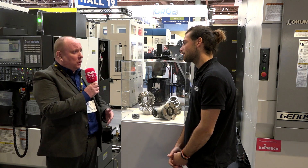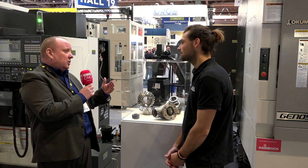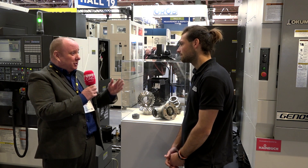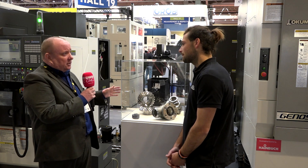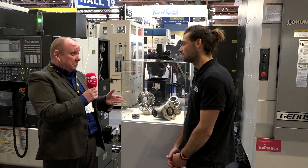It's a good question. You can see there are several companies selling CAM software, and that's good for general purpose, but we don't do the whole component — we look especially at the teeth. That's because where you might have tolerances of plus or minus 50 microns for general surfaces and mating, in the terms of gears, you're talking microns — sometimes even sub-microns can make the difference in performance with noise and stress levels, between success and failure.